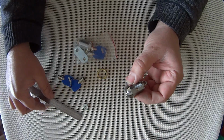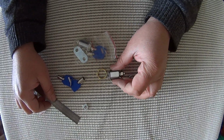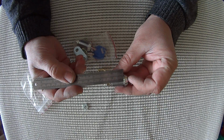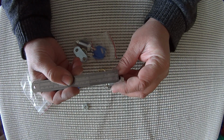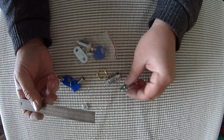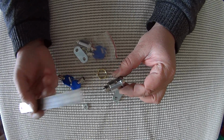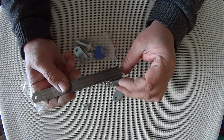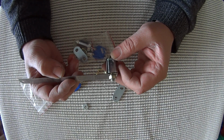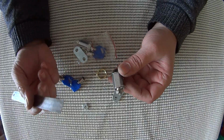Now, this particular lock, a lot of people are buying these locks and they're saying, oh, look, I need it for my mailbox or I need it for this cabinet. I'll just buy this one and it will fit. Keep in mind that when we're talking about the size of this lock, we're talking about from under here to where it actually locks into. Okay, so you can see here it's about 20mm. So where it actually locks into would be like 30mm. So where this tail locks into. So from the front of here to the tail is roughly where we're speaking about. The actual length of the body is close enough to be exactly the same as what we're speaking about, but you don't count it from the front, you don't count it from the top of the screw. You're counting from where the action happens, which is about here, and the action at the front of the cabinet where it will actually sit onto the cabinet.